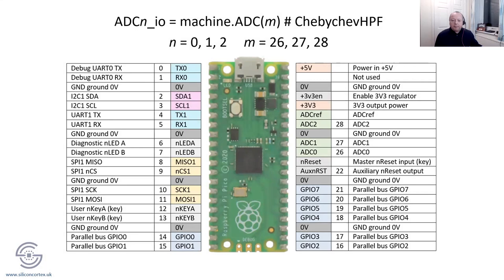You then want to plumb that into your Raspberry Pi Pico. It would actually be dead easy just to plumb the output of that, but not the negative voltage, so make sure you handle that one, into one of the three ADC ports, and then you can just easily read. No drama at all, dead easy to do. And I think it just offloads a whole load of programming headaches, although, like I say, it is analog electronics, and that can be a bit daunting.